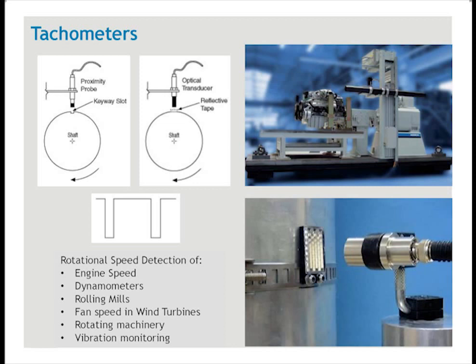The tachometer is an instrument that measures the rotational speed of an object. They typically have a dial or digital readout to indicate speed in RPMs. It works by counting pulses generated from an alternator, ignition system, or speed sensor. The sensor can be magnetic or optical. Magnetic types include mag pickups, inductive proxies, and Hall effect sensors. Optical types include photoelectric or laser that focus a beam of light against a reflective element or slotted disc. With an electronic tachometer, a digital output signal can also be transmitted, typically TTL compatible as a 5-volt square wave output that connects to a counter or signal conditioner.